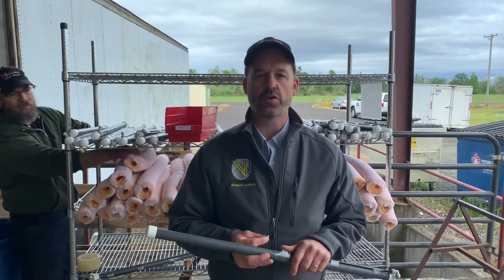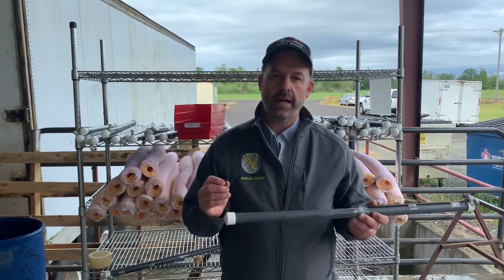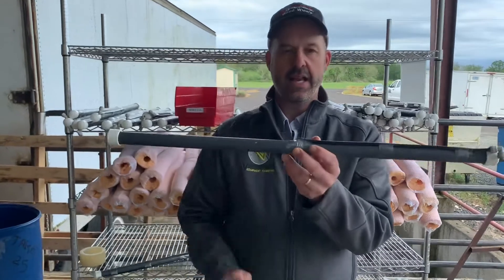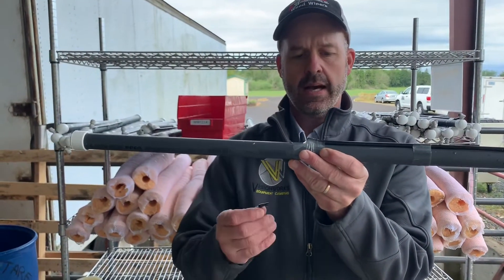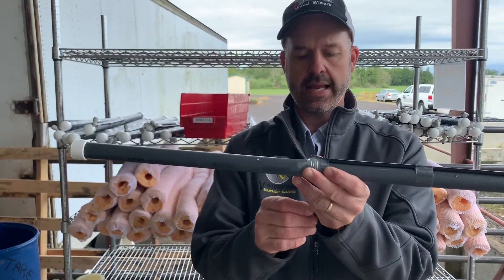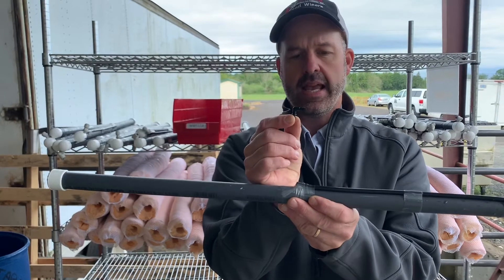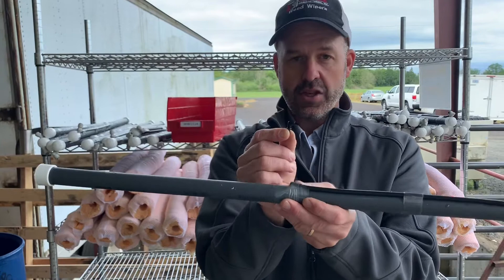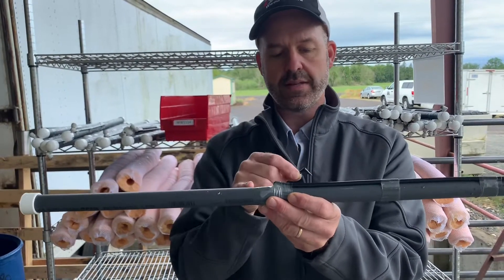It's a great way of controlling weeds — taller growing weeds in your crops. This video is directly about fixing an issue that we had in our weed wiper feed system. In October, we got a batch of elbow fittings from a vendor and didn't realize that in some of them, there are obstructions in the channel, restricting the flow going to the feed system.